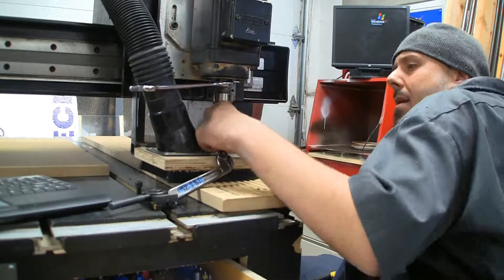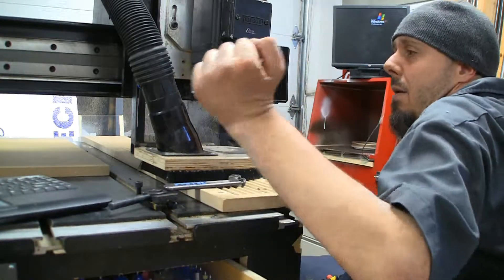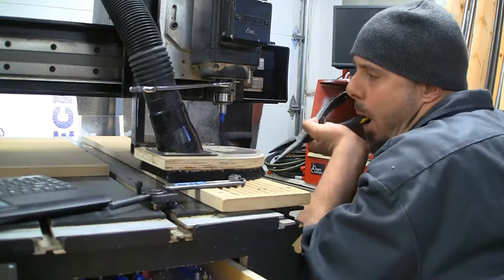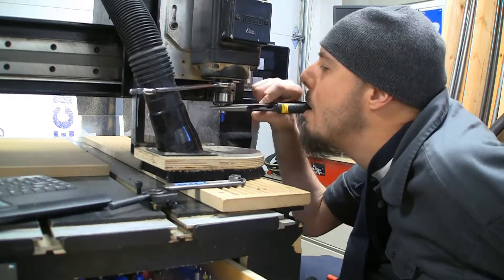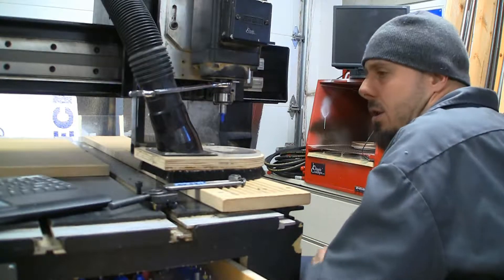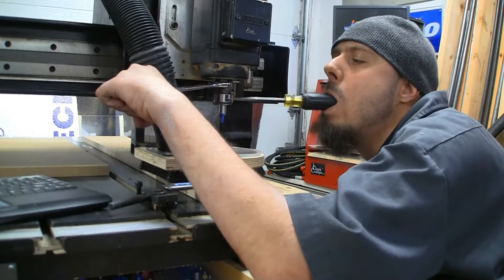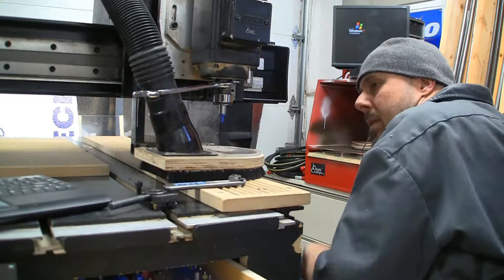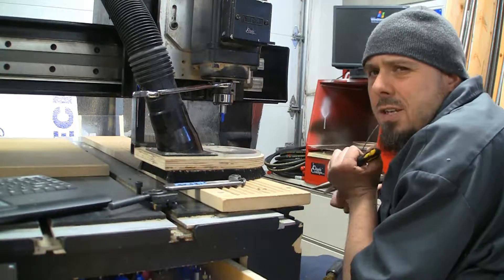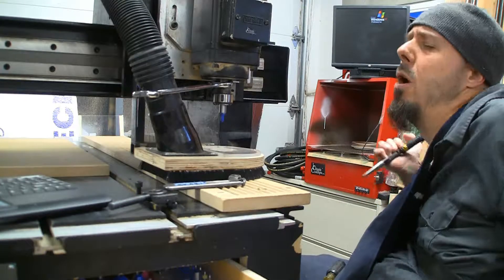That works way better than getting the pin wrench back on there. So now the collet is loose, but if I try grabbing this bit, even with two hands, I still can't get it out. So I take my handy-dandy needle nose here. Maybe my collet is not loose enough because it isn't budging. Sometimes with these collets, you have to push it in a little bit - it'll pull out easier then. I forget what kind of collets these were. They're some weird size, they're not ERs, not double taper. They're some odd collet - they came with the machine.